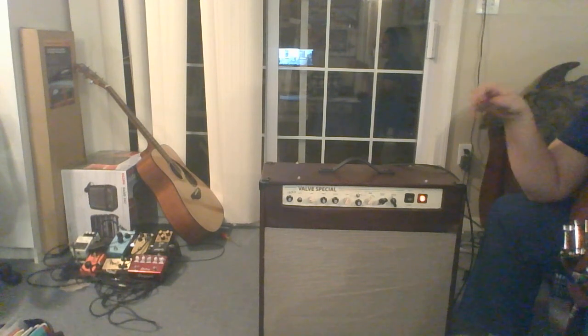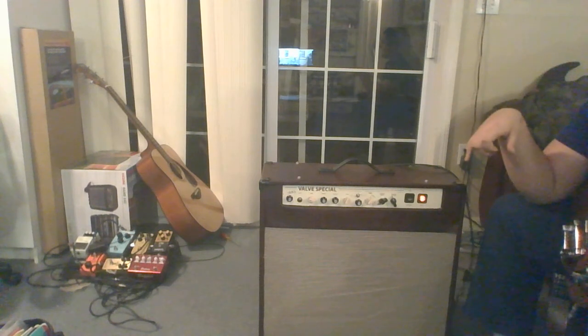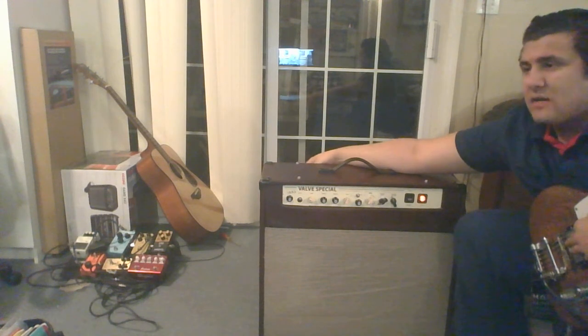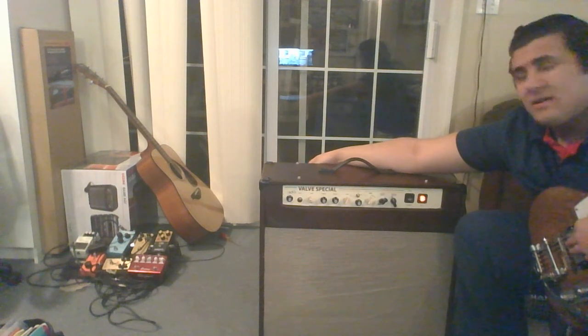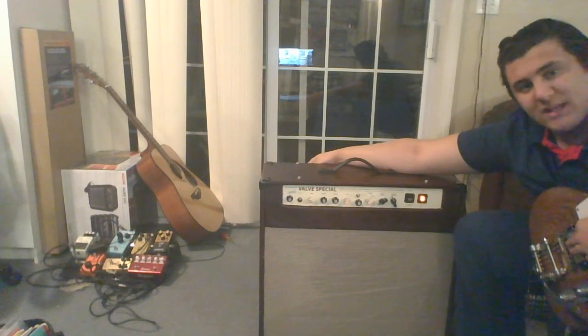It runs it into V2B, which is a warm biased gain stage. So V2B actually has a bypass cap as well. So let's go ahead and put it on. 0.68. Every time this thing vibrates, it's going to make that noise now.